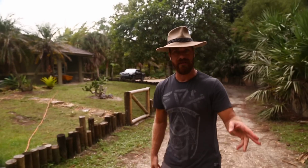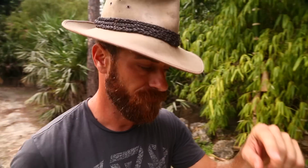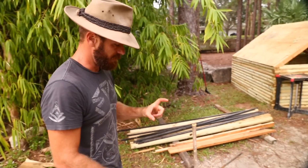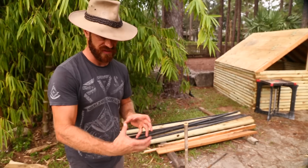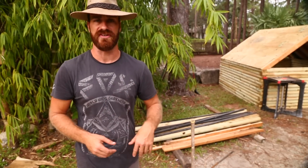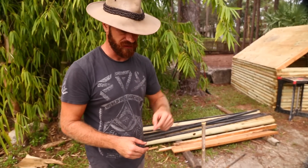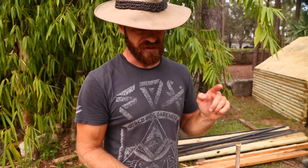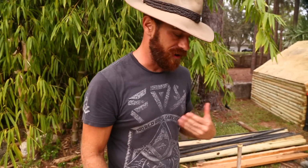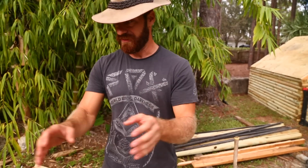Then you take that same drill and you only go halfway through, because when you go halfway through, you'll be able to get a 3.5 inch screw into both pieces of board so they lock together. So every time you put a new course on, you have to pre-drill a little bit halfway, and then you screw in a screw. Or you can buy long timber lock screws, which are much longer, but they're also kind of pricey. So I went with just screwing down every single one.